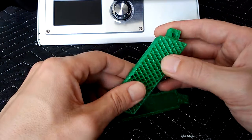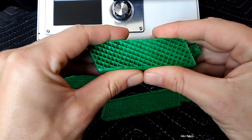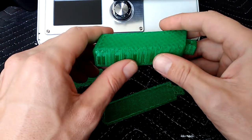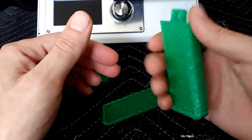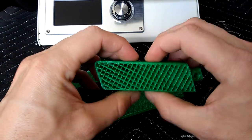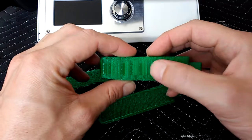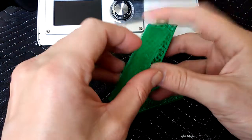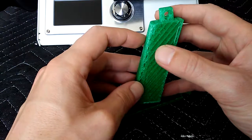The other thing I did was I printed the infill at a line width of 0.2, and it seems okay, but I can tell it's a little more flexible than other pieces I've built — and this is one of the larger pieces I've built. Also, the thin walls are not quite as resistant; I can kind of push through here if I want to. So lesson number one: don't reduce the outer wall thickness to below 0.4 millimeters.